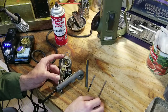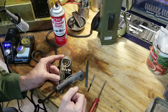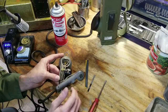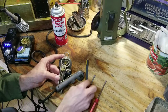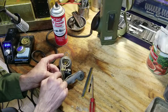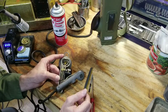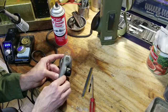Miraculously, when I finished doing that, I ohm'd it back out, put the contacts in touch with each other, and was able to get conductivity between the two. So if you've got a T17 and just can't get it to work and you're determined enough — clean contacts are important, but you may need to restore the connection of each point to its metal reed. A hot soldering iron did the trick for me, so maybe that will do the trick for you too. And you can be back on the air.